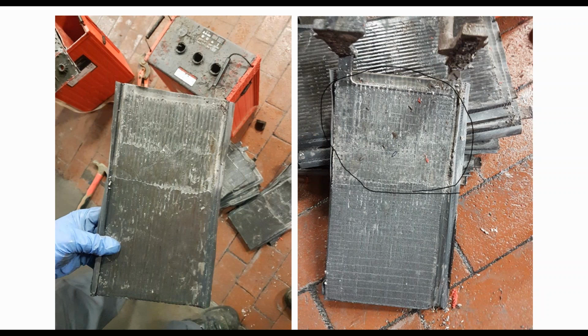So any battery that's been tipped and exposed, and then has been exposed to oxygen for too long, will start this process of dying. Typically, with this battery, they probably ran it dry in the first 6 months and made the mistake. We replaced it under warranty, assuming that everything was good, but it wasn't performing very well. We replaced the battery. Of course, now it's performing great because they've got a new battery bank in there. But the rest of the batteries are probably going to also start showing this in the future.